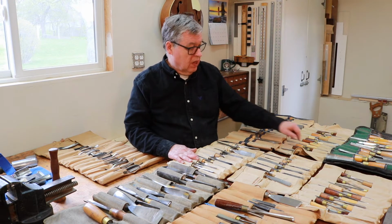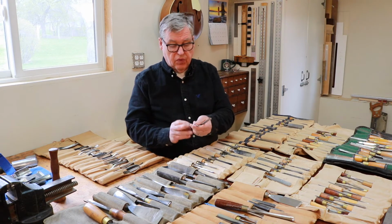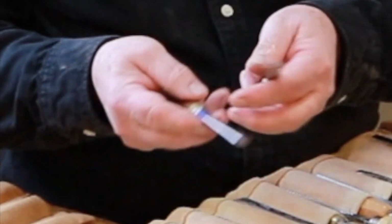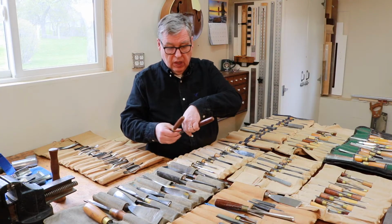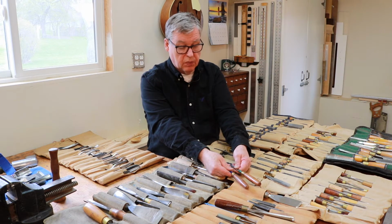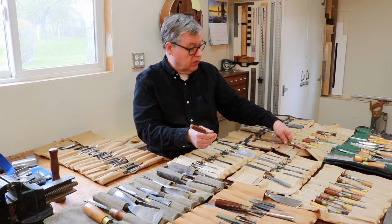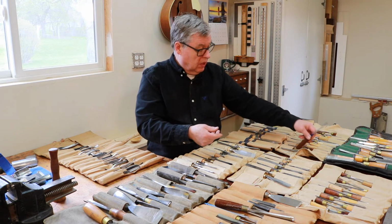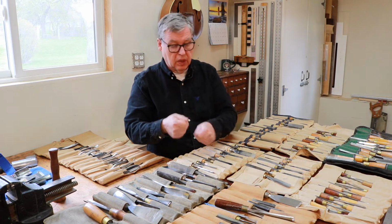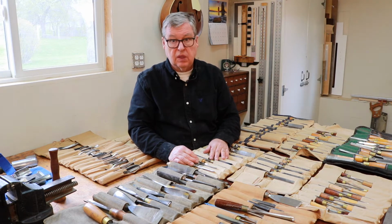And sometimes when I have a couple tools out that are very similar, but I need them for different purposes, these are very close, I'll color code them with tape. And when I lay out my tools when I'm carving, I always have the edge toward me so I know which shape to grab. Because when they're this way, all the handles look the same or very similar. So I have the tool edges pointing toward me, and I'm paying attention to what I need to grab and being careful that I don't poke my hand into it, because that's happened before.